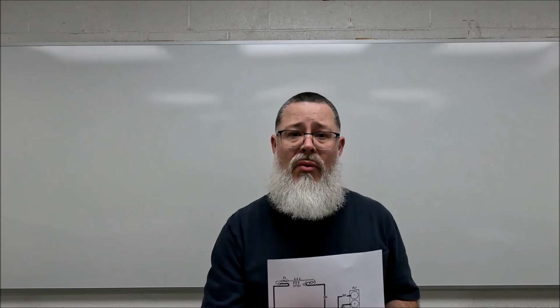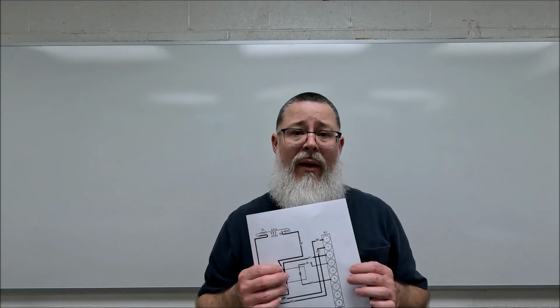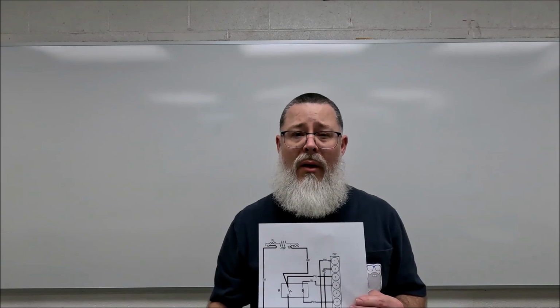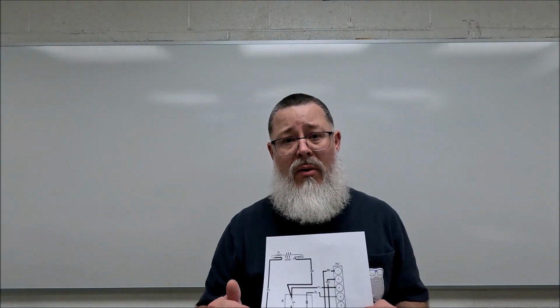So that purple wire is going to be bringing power into the female plug and into another circuit that we're going to get into with the air handler. Before I get off of this completely, I also want you to look down at the bottom at the terminal block where we had L1 and L2, and I want you to notice that there's two wires on each side of power there. So there's two wires on the L1 and there's two wires on the L2.